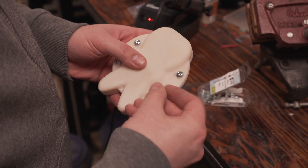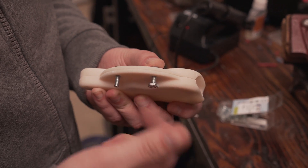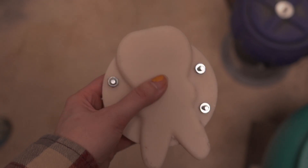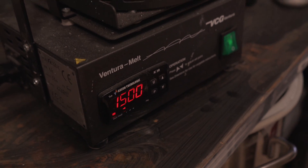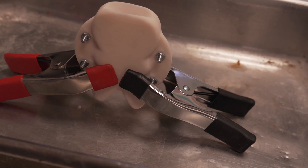This was a fun project to try, but it's in no way something that should be done by anyone who doesn't know what they're doing. Die casting is pretty much done cold by comparison to other methods like lost resin or lost wax casting, where the mold is typically very hot — like a thousand Fahrenheit. In this case, the mold was just warm enough so that we didn't create a condensation explosion when we poured the hot metal into it.